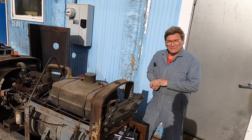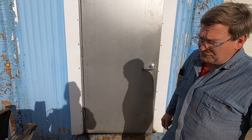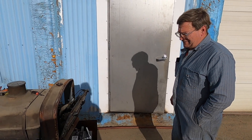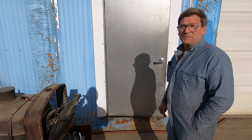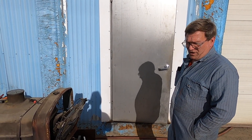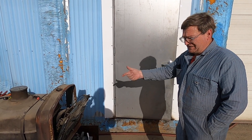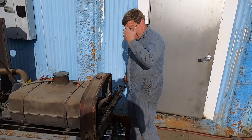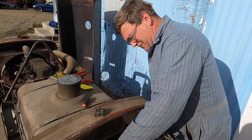So what's going on here with this welder — it is an SA 250. I looked on the internet and for some reason nobody is talking about the field excitation on this machine. This particular one uses AC off of the windings, then rectifies it and sends it out as DC to the welder field. The most common place that goes bad is going to be this diode back here.